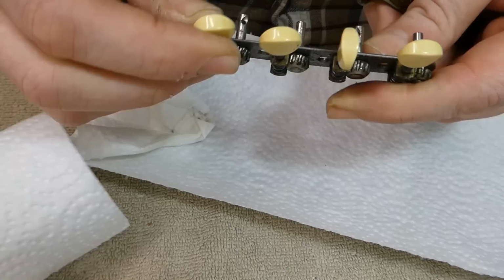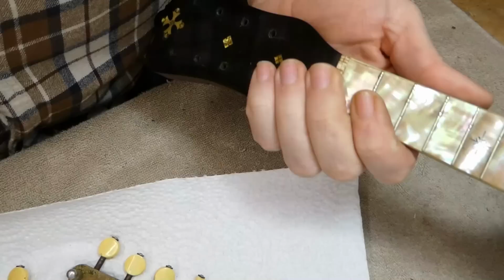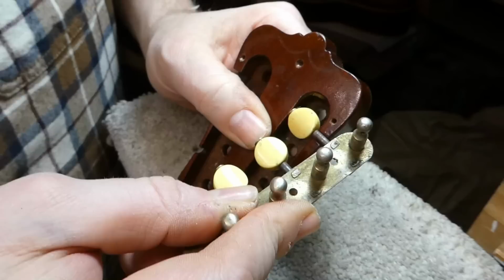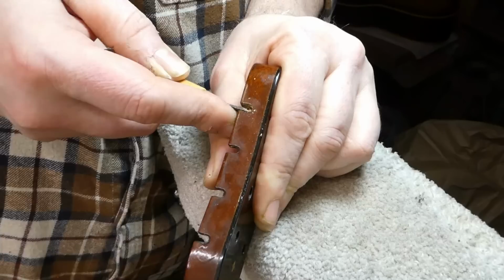These shafts are sized to fit a quarter inch hole, 250 thousandths, 6.3 millimeters. I think I prefer not to drill these holes. I'm going to ream them from both sides. Yeah, these cutouts for the shafts are in fact too snug. I have to carve away a little piece on either side to make those fit. This whole arrangement is entirely too delicate. It's not designed to bump into anything, that's for sure.